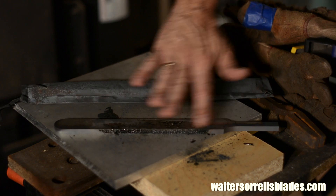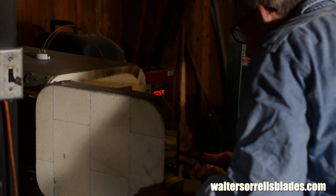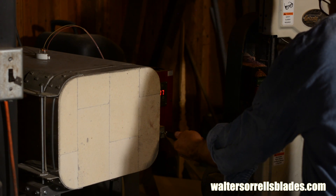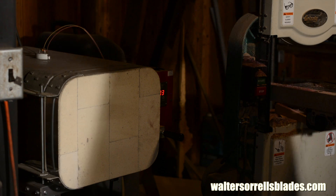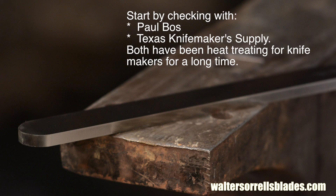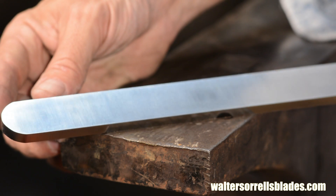D2 should theoretically harden to about 62 on the Rockwell C scale when tempered at 400 degrees Fahrenheit — that is nice and hard. Now, remember I said we could do this an easier way? There are commercial heat treaters, including suppliers of knife making supplies, and you can look all those guys up on Google. Go to their websites and they'll tell you what you need to do, but basically you just send the tool to them with instructions on the type of steel you used and what you want them to do with it. And a couple weeks later, they'll mail back a properly heat treated tool.